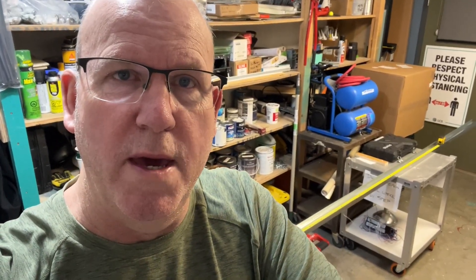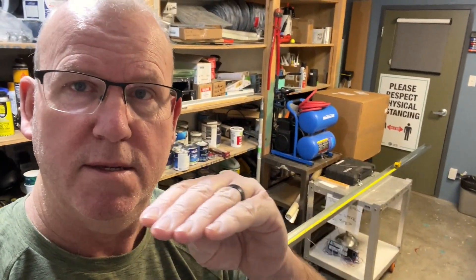Looking for metal to make a filter rack out of, I discovered that finding the right gauge of metal in very small quantities is overpriced. I have some flashing material, but that's too thin — it might be like 22 gauge or something. I need something more along the lines of 18. The other issue is that I don't have a metal brake long enough to put the bends in anything other than short little pieces, and I'd kind of like to make this one continuous piece just for strength reasons.